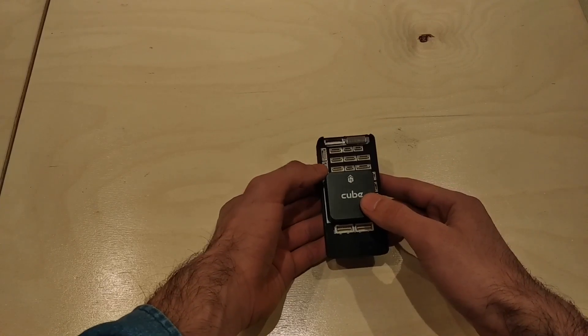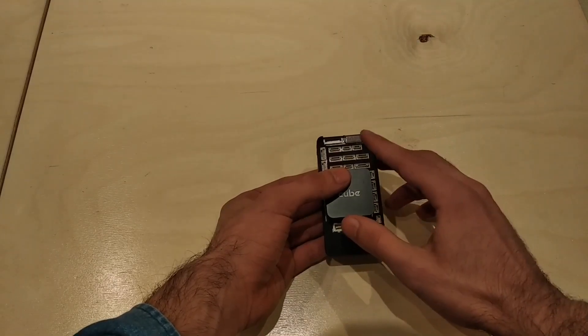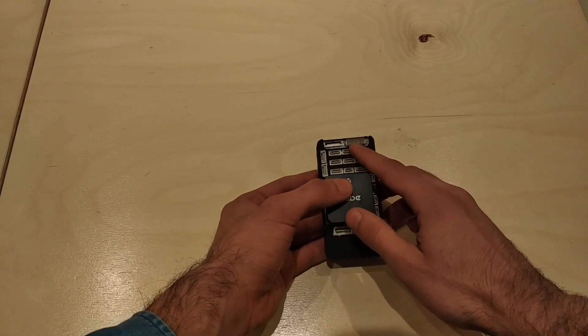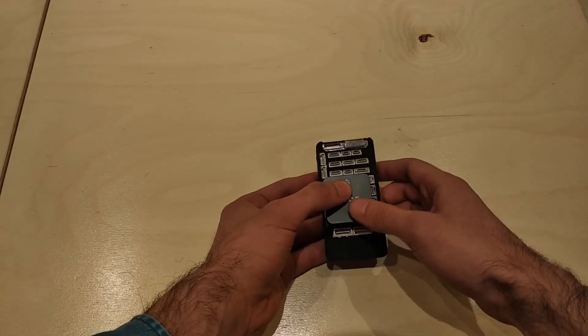Additionally, we have connectors from the Raspberry Pi Compute Module 3: a UART port, SPI port, two camera ports, three USB ports, I2C ports, and two GPIO. Camera one port is a 15-pin CSI port, and camera two is a 22-pin CSI port.